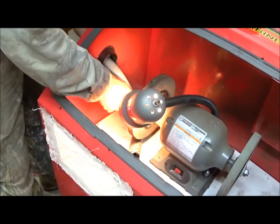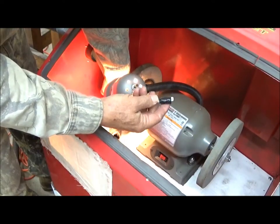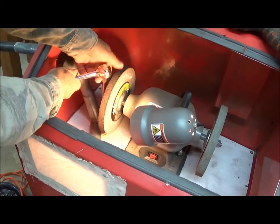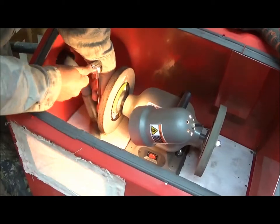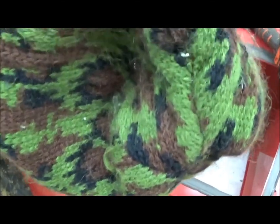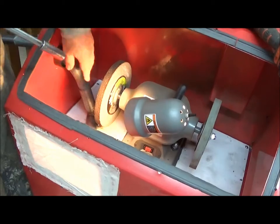I don't happen to have any metal strapping tape, so what I'm going to do is wedge the work right here and put in a single heavy bolt with some wraps of electrical tape on it to sort of dampen the sound. That's pretty solidly held — that's not going anywhere. No metal is in contact with metal, so that's about as vibration-free as I think one can get.